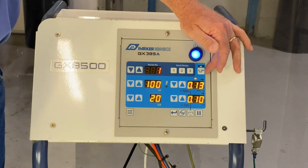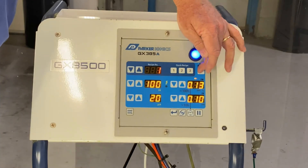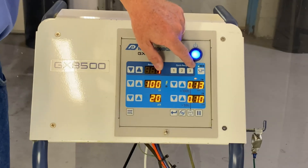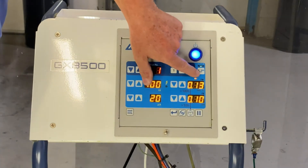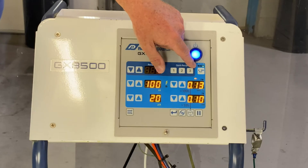Right here is your pulse power, super pulse power selection button. Your first choice is A mode — Almighty mode — for spraying flat panels or non-complex shapes. The next selection is F for Faraday mode, which sets up the pulse power to optimize for Faraday cages. Your third choice is R for recoating — if you're putting on a second coat, R mode is perfect for you.